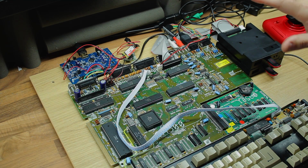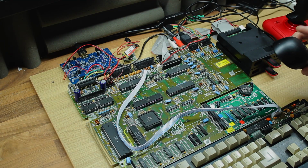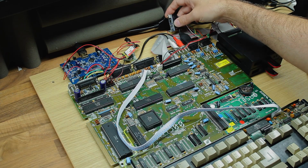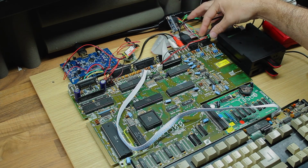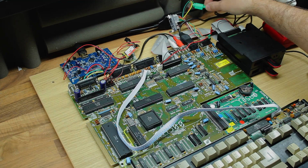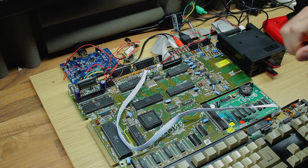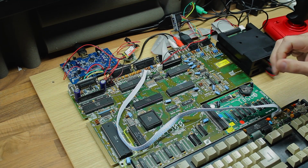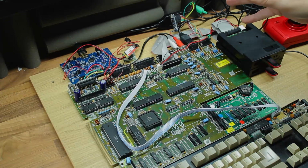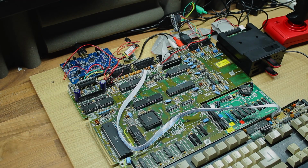But the biggest change is I have a mouse now. I've cobbled together a little Arduino board connecting into the mouse port and connecting up to a PS2 mouse. Written a bit of software for it, which is on GitHub if you want it. I'll put a link to it in the description below. It's only about 15 lines of code. But I actually have a working mouse now.